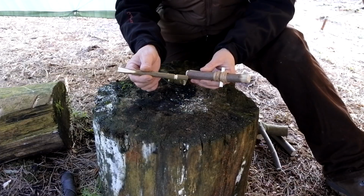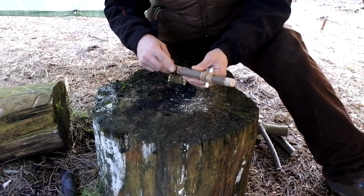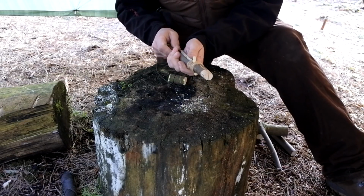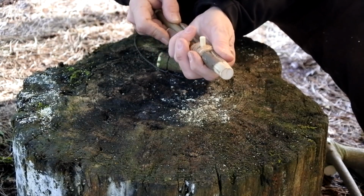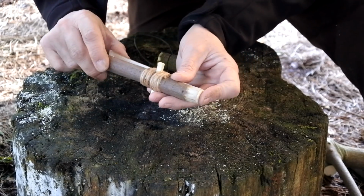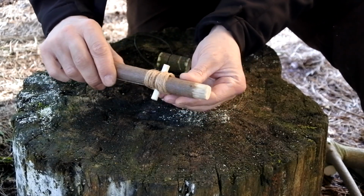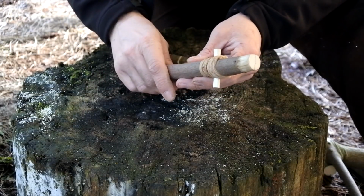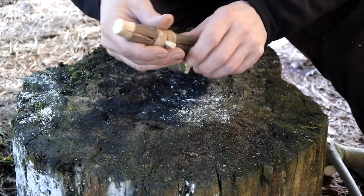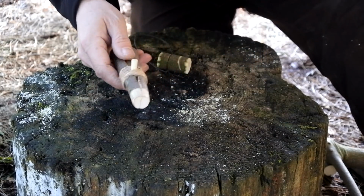And then we're just going to make a simple wedge, which actually pushes in the back. And as that pushes forward, them two little jaws on the front there close up, like so, and as you push that forward, them jaws really do tighten up, and that will take quite a bit of pressure. I've seen traditionally these used where people would put a hook in the top and use that for a little bit of fly tying, often referred to as a finger vise.